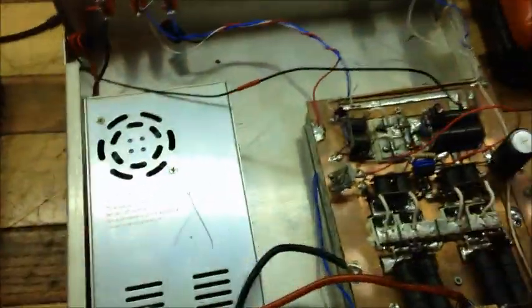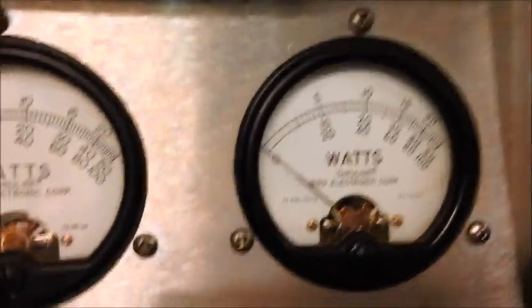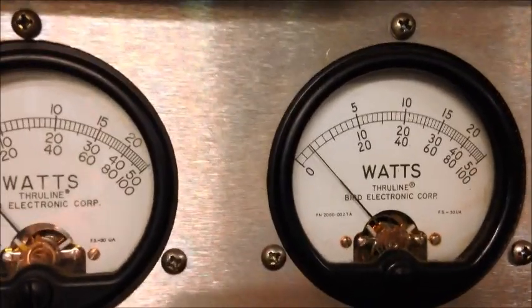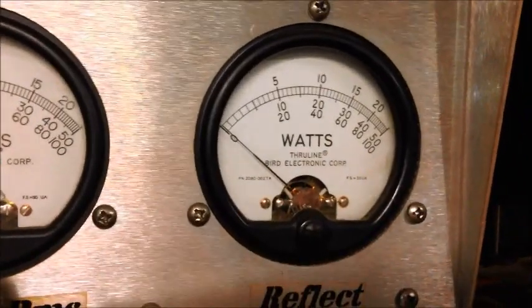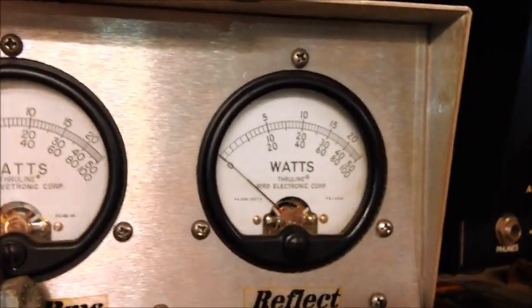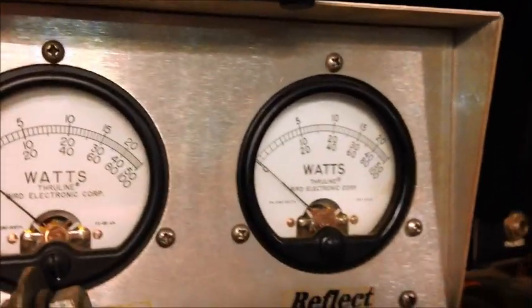Working really good, turned out fantastic. I've still got to get the tuners out and set the capacitance, but it's all tuned out. The reflect — on my 5 watt slug which is what I use at the radio, it was just driving it right over to the corner. Look at it now — that's the way we like to see them do. We like to see them swing back a little bit, get them set as low as you can, and try not to have it swing too much forward. But sometimes forward is modulation. I've always liked to see them swing back.